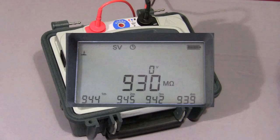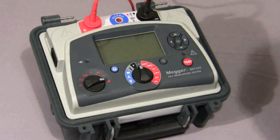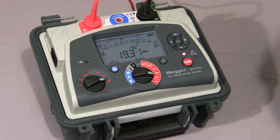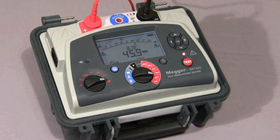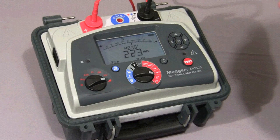And finally, I'll show you the ramp test. First, we select the ramp symbol on the mode switch, then select the test voltage, and press and hold down the test button until the test commences. In this test, the voltage is ramped up at a default value of 1,000 volts per minute as per IEEE 43-2000. The test is nearing completion and the voltage has nearly reached 5,000 volts. Normally, you would either log the curve or stream the data to a PC for later analysis of the current curve.